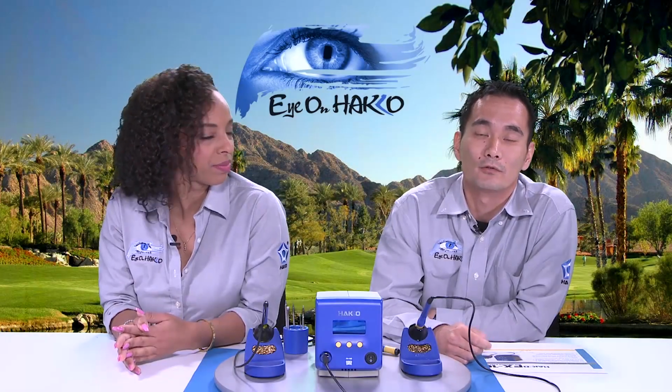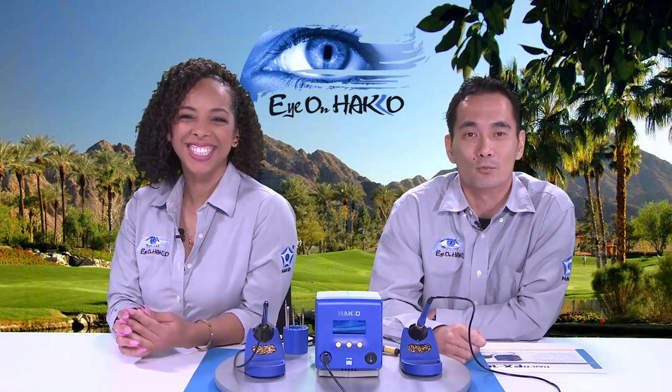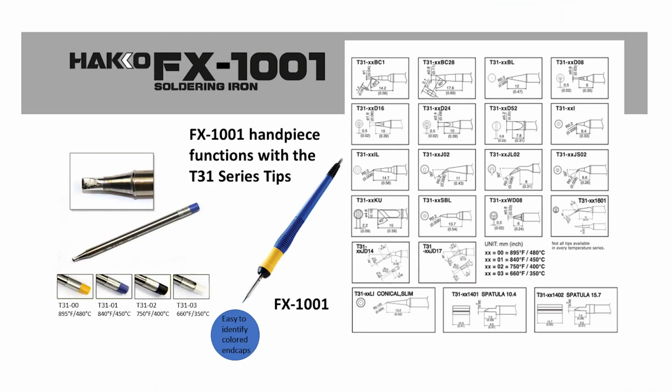Okay, let's get right into the standard handpiece used on the FX-100. It's called the FX-1001. We're going to put up a slide, so you should be seeing the standard iron with the tips. The tips used on the standard iron are called T31 series tips. Again, the technology of induction heat has been around for a very long time, but a key benefit of our FX-100 is within our T31 tips. We have redesigned the tip construction and also the coil design inside of our tips.